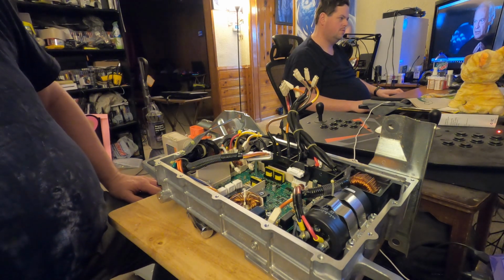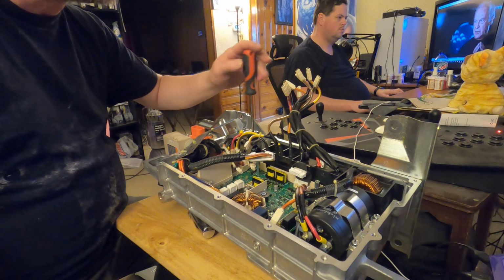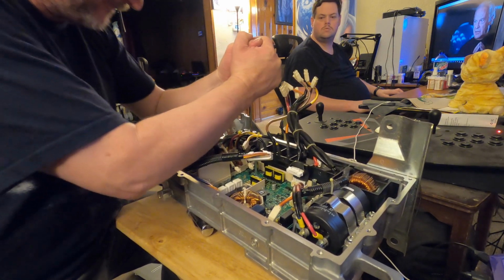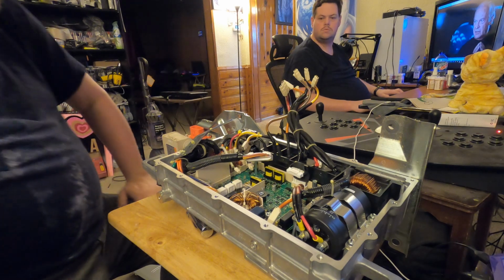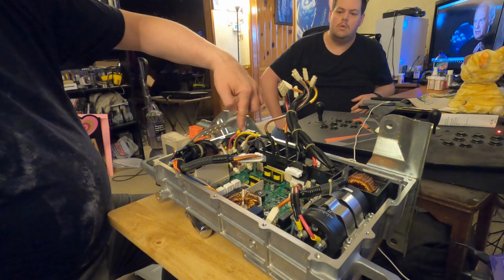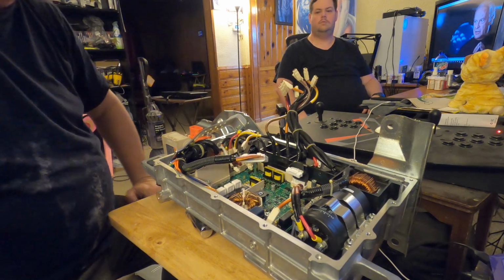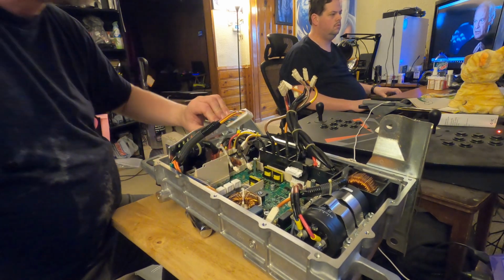Well, that might be where we stop here on this teardown, because these screws basically just dissolve themselves. I'm not going to be able to bite with anything on these top two, and I'm not drilling these out. Unfortunately, I'm not going to be able to get down to where I was hoping to get without doing damage. These two screw heads, when I put torque on them, just mushroomed out, so they're dead. And trying to get the bottom one at the angle, it's wanting to do the same thing. Something that apparently was made to fail.